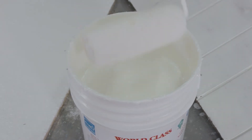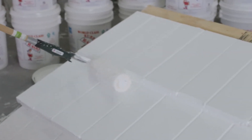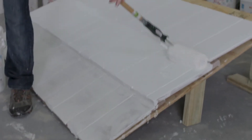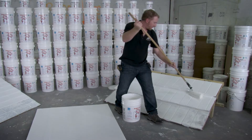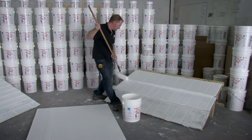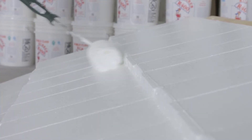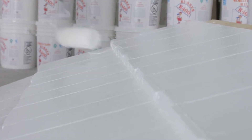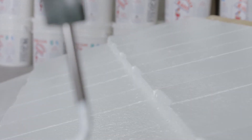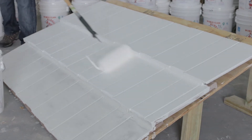I always like to take a quarter dip for the tile nose seams, give it a swipe against the bucket to make sure we don't have drips, and then run the edge of the roller along the edge of the tile to fill any seams. We did this with the first coat but it's always good to make sure everything is uniform and done the same way for both coats. Then you take your roller, pat out any excess from the overlap seam, run across the top nose of the tile to remove any excess, and do the same across the bottom — that also gets rid of swirl marks left by the roller.